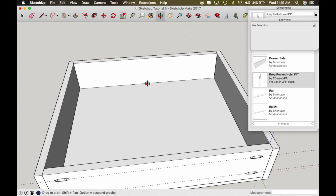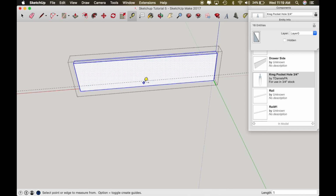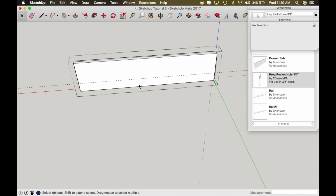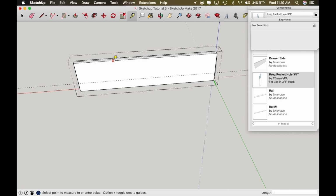So if I put a 1 inch line from the bottom of the actual drawer front, it will be a little too close to the drawer bottom. So let's accommodate another line that's 0.5 inches from that 1 inch mark. So that will give us 1 inch from the actual drawer bottom instead of the edge of the drawer front, if that makes sense. So let's drop a 1 inch line here. We don't have to accommodate anything from there. There we go, 1 inch.